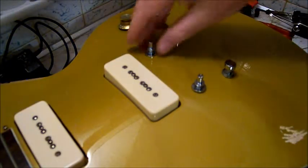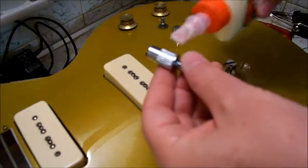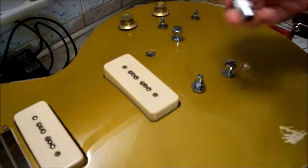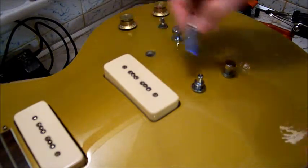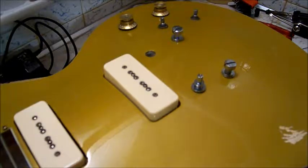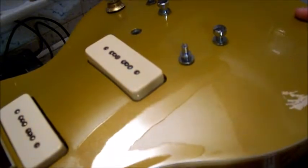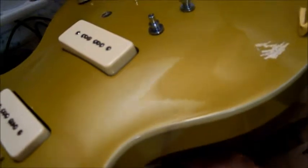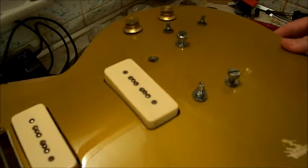It's an extremely easy fix. All I'm going to do is put glue on this and then push it in - but if I put glue on the bushing and push it in, all the glue is going to seep out the sides. So then I'll have to clean it all up, and that's not cool. So what I'm going to do is put glue actually inside the hole.